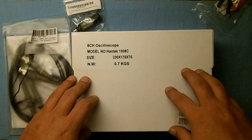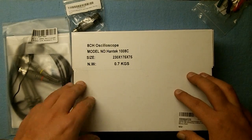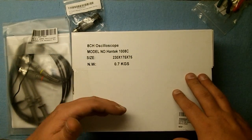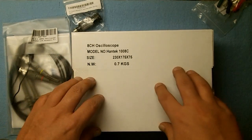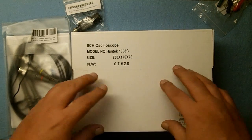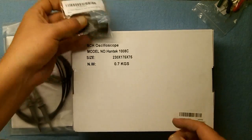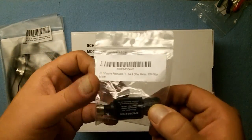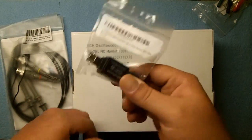One of the things that really sold me on getting this was a bunch of videos by a YouTuber named Enrique Osorio. There are Hantek 1008 videos online, but most of them are Chinese, Russian, or Spanish. Enrique Osorio is a BMW tech and the only one with videos covering what this thing can do. It's advertised as an automotive DSO, specially built for automotive applications. You do need the 20-to-1 attenuator — older PicoScope owners will be familiar with that, though newer models have it built in.